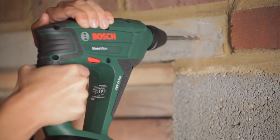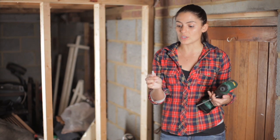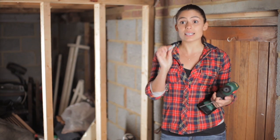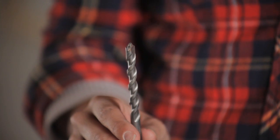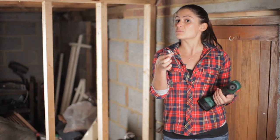The thing that's giving you the power is the pneumatic drill itself — that's why it's going to get through the lintel. Then what you need to do is get the right size. The wall plug we're using is an 8mm plug; it says that on the packet and it tells you which drill bit to use as well. You can also just hold them up to each other if you don't know the size and see that it's the same.